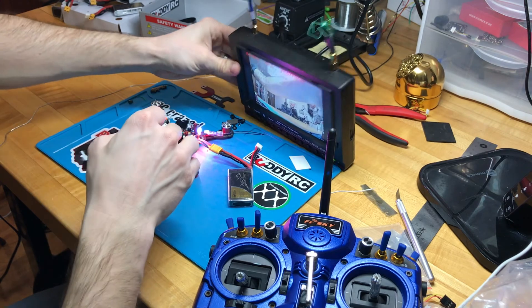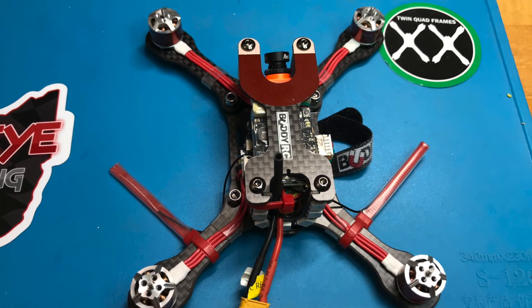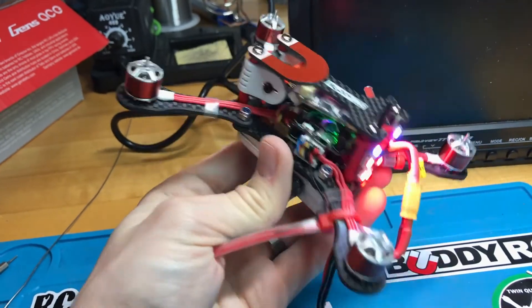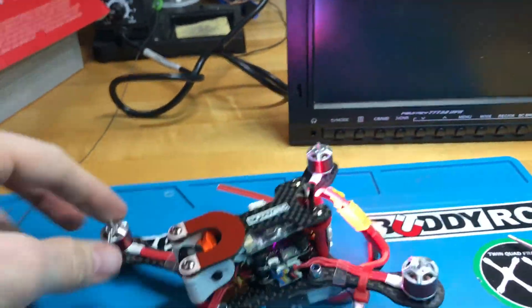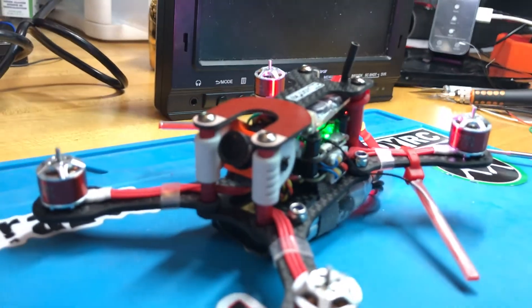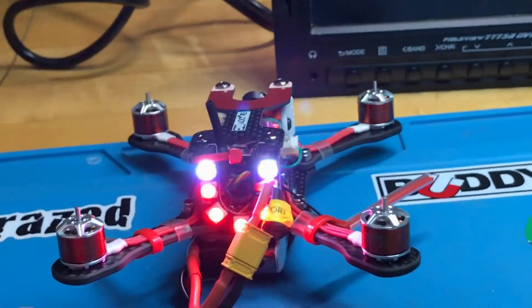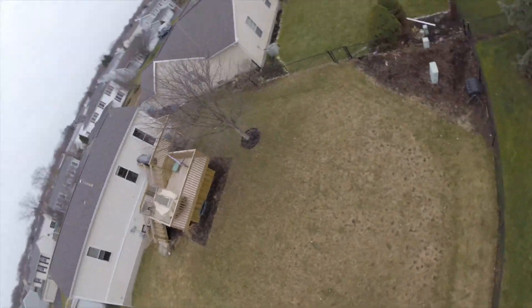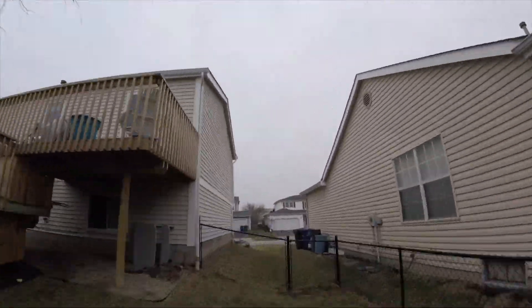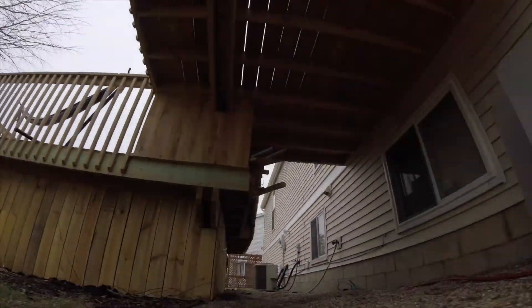At this point I'm feeling pretty good about everything — it's all configured and working. I'm putting it all back together and getting it ready to fly. Here it is with the zip ties in place. You can see how I've got zip ties on the back arms with the zip tie aiming forward, and I've run the receiver wires down along the zip ties with heat shrink to hold them in place. I've also added a zip tie to the video antenna in the back, holding it to the vertical standoff to keep it out of the way of the props and keep it vertical for good video reception. Your quad should be fully set up and ready to fly. If you have any questions, feel free to ask in the comments. Battery testing and flight videos will be in the next video — if this helped you, please drop a thumbs up and consider subscribing.